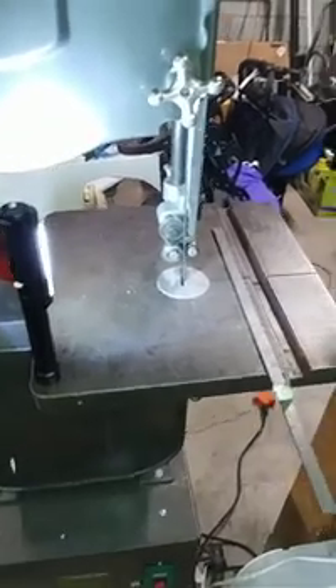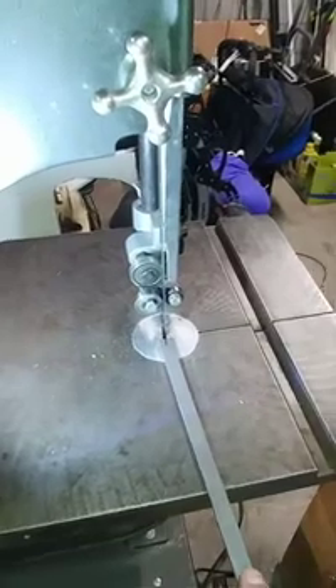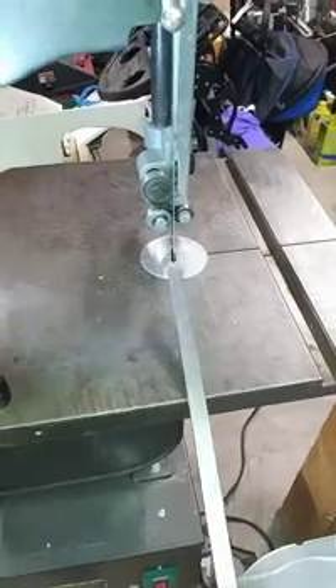Let's stop talking, turn the saw on, and I'm going to do a one-hand cut — safety first, I know, but I just want to show you. So, cheap blade, 14 teeth per inch, my converted wood-cutting saw. Pretty noisy. Yeah, it's cutting it. This is mild steel, 1/8 inch thick, and we're cutting through it. With a new blade it's actually cutting pretty quickly and relatively straight too. I didn't really make a big effort to cut straight, but even one-handed I was able to control it.